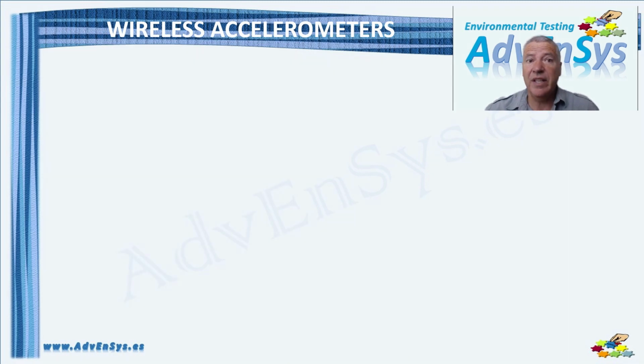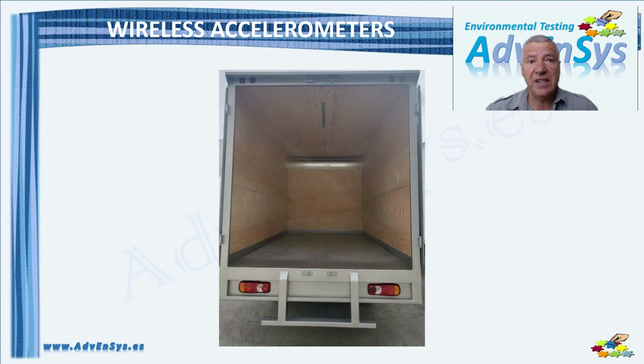Vibration and shock data gathering is, however, a suitable application for this type of sensor, since data is usually taken in time blocks, either in fixed time intervals or when recording is activated by a threshold level. Battery life is preserved, and high accuracy is not so critical, since we will post-process that information to generate a statistically calculated PSD that somehow averages the acquired data.